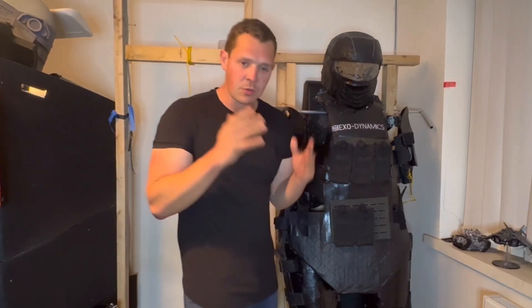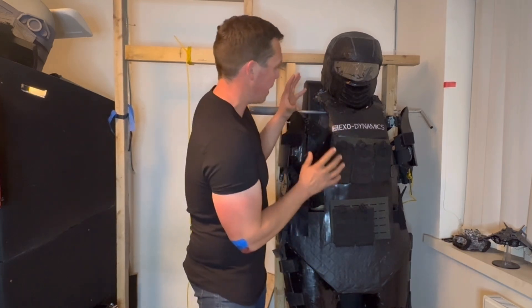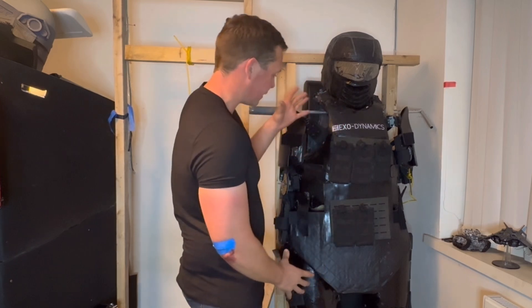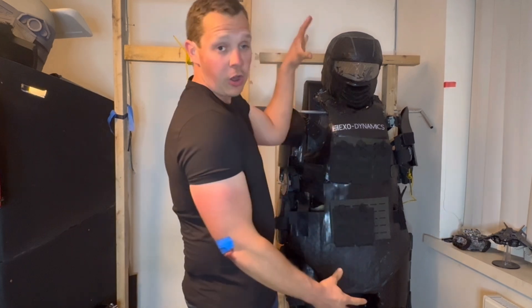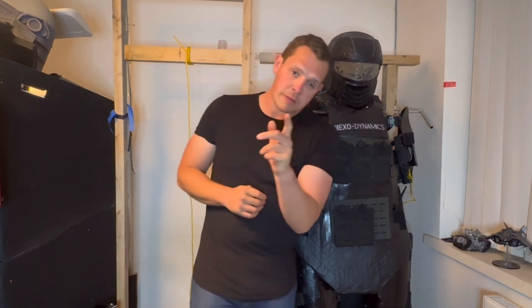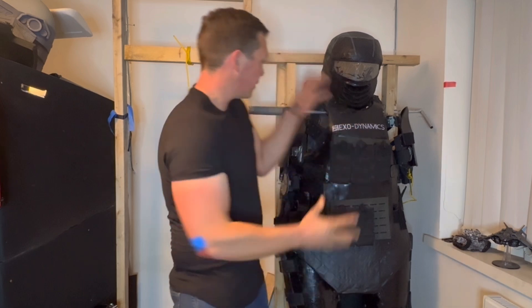So what was the reason as to why I wanted this to be able to split into multiple pieces for putting it on? Originally my intention was to have this all mounted on a frame, with some Iron Man-esque thing where basically you'd open it all up and then step back into it and either latch into it or strap yourself into it. The problem is any latching mechanism is extremely complicated, probably going to break, and you run into issues if you're going to have thick armor on it, which then gets you into using velcro straps - which is basically what I'm doing now.